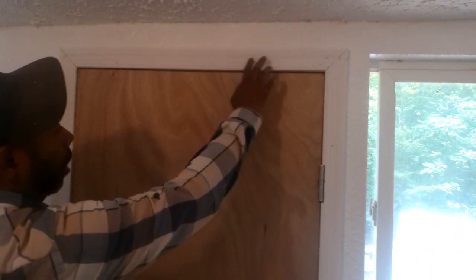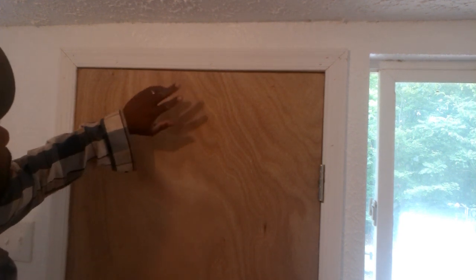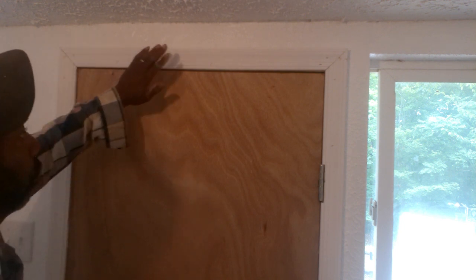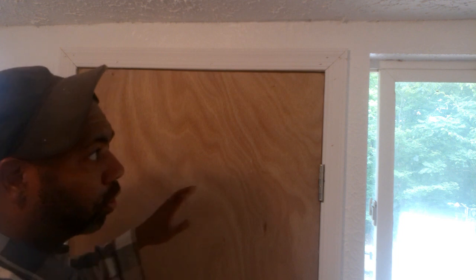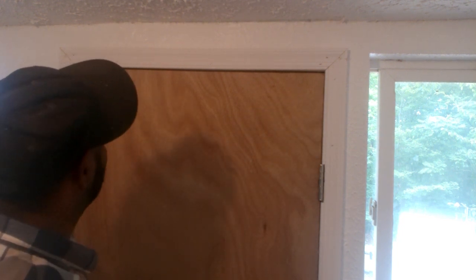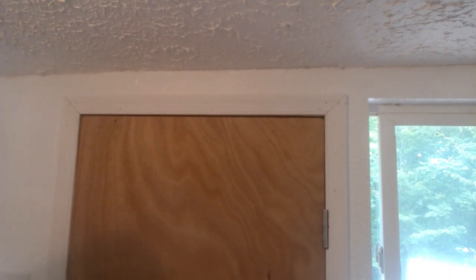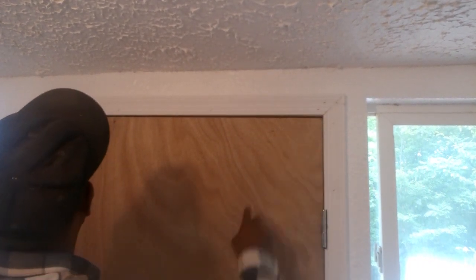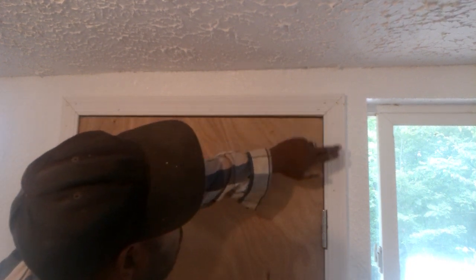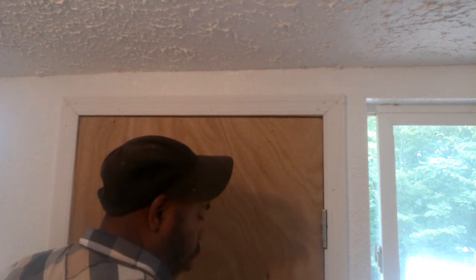Got the trim around the door. If you had the whole door insert with the trim and all, you wouldn't have to do all of this. But this room is not square — the door height is not normal height. I had to cut the door down, so I had to improvise. These shows don't show you when you're working on an old house or how much improvising has to be done. So once you put your trim up, go back with some dap, some caulking, and go in all your seams around where your staple nails are at, and fill them in with some dap or caulking. Once you've got this in around your door, then you can go to the floor and finish it basically.